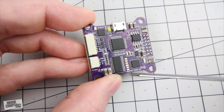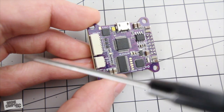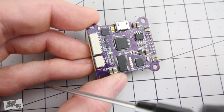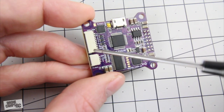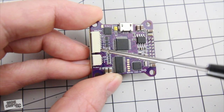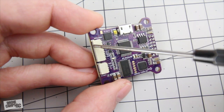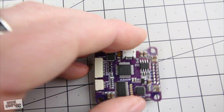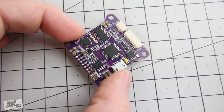If you want to run PPM, use the top pin of that port configuration — ground, 5V, and your channel 1 signal wire. For PWM mode, you use that same port with the full signal wire cable harness that has every single wire. PWM is an older way of doing things — I don't really recommend it, but I'll respect you at the field regardless. PPM only needs three wires, and S.Bus also uses three wires but runs off the bottom middle port.